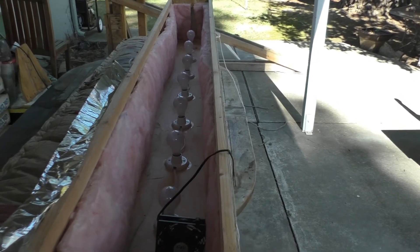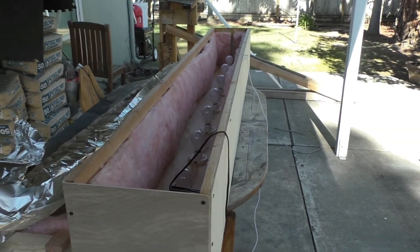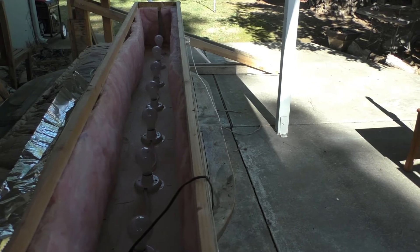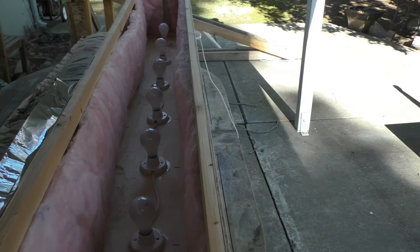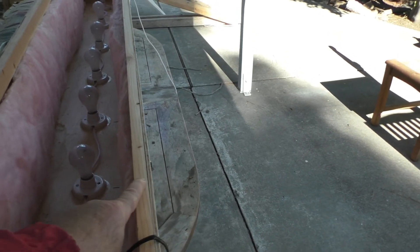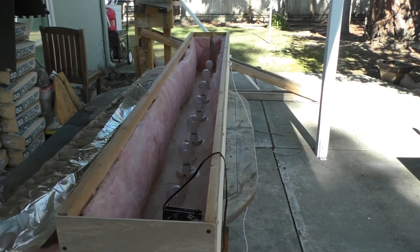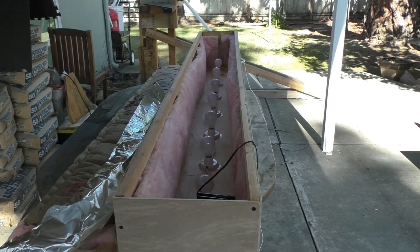So if you're building anything composite, an oven like this can come in handy — a long skinny one like this for making tubing and L-bracket material, or build it in a different shape for different parts. I don't have it on here, but you might want to consider putting some temperature-resistant weather sealant along the top to get a better seal on the lid and hold the temperature better. Build one for yourself and make better composite parts. Thanks for stopping and visiting today — spread the word, bye now.